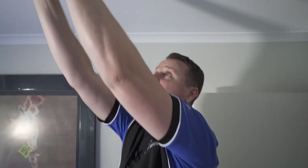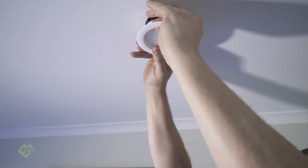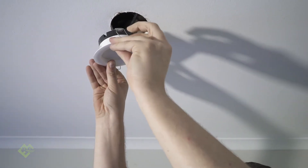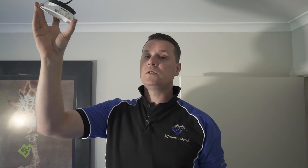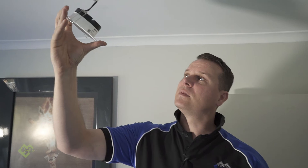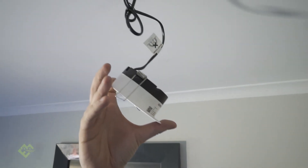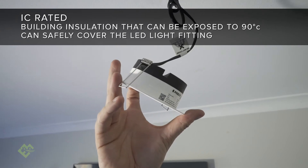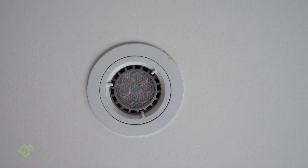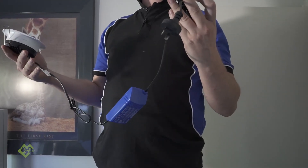If you're not comfortable doing this, it's important that you get a professional to do it for you, especially if you're not sure what sort of transformers you've got installed in your roof area. Another important thing is that when you get luminaires, the best type to get is one that's IC rated, which means it can be in contact with insulation. The issue with LED lighting is that even though they get a lot less hot than halogen globes — halogen globes are like little ovens — LEDs are a lot more sensitive to failing when operating in higher temperatures.